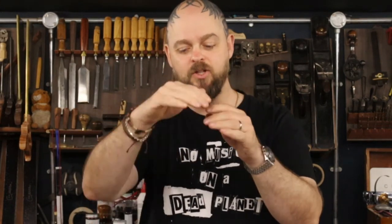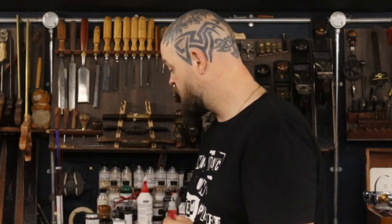Now, you should be able to do the same thing using a round over cutter on a router, at least to start everything, but you've also got a lot of grain direction and a lot of very soft grain there, so take as little as you possibly can. Other than that, another option that I haven't tried, but now does occur to me, is a beading tool of some sort, i.e. a shaped scraper, a blade that's got the radius that you want, and it's literally just scraping around. And that would be the best tool for the job.